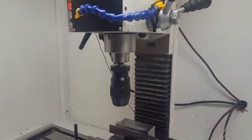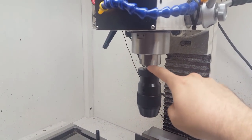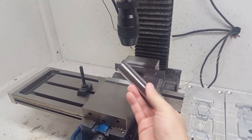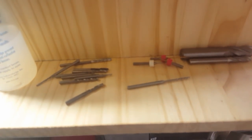And in here right now I have this extra drill chuck chucked in here, but normally the end mills are about right up here. And I got several different collet sizes. This is what it uses in there. Like this, you can put the 1/8 inch size end mills up in there. And here's some of the bits that I used to actually cut the mold out.